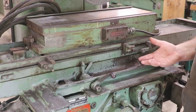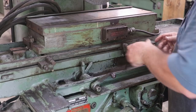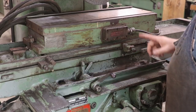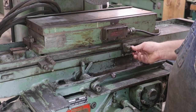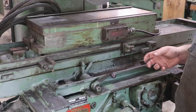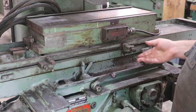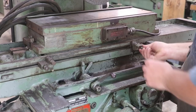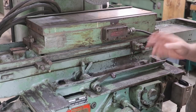Another thing that was aggravating is these adjustable stops on the front that slide in and out to adjust the stroke. If you're grinding something small, you don't want it to cycle the entire width of the mag chuck, so you can easily adjust these. On one of them, the original T-slot nut was no longer in there — they had put just a socket cap screw through, but because it wasn't square in the back, it was just spinning, making it very difficult to tighten. I was able to find a square-headed bolt, put that in, and now it's easily adjustable.